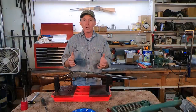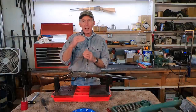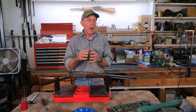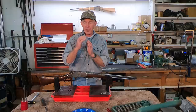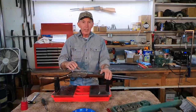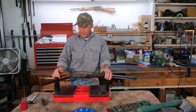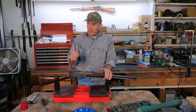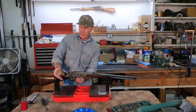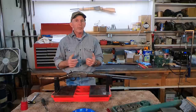This is a problem that has to be corrected. What typically is wrong is either the hammer notch has some damage, or the sear has some damage, or both. In this case the owner tells us it has a hair trigger, so I'm assuming it has been modified in some way - the hammer notch is very shallow and probably over time it's worn a little bit. The nice thing about these toggle link guns - 1873, 66, 76 - is we can take the side plates off and look in there. I suspect we may have some damage or even a broken sear or trigger spring, so let's find out.